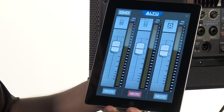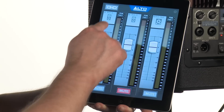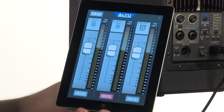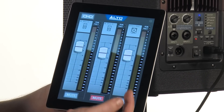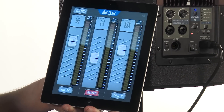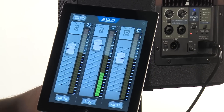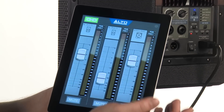When I open up the application after I've updated, you'll see here I have a lot of different controls. It's going to represent each one of my loudspeakers in my system by an individual channel strip. On these channel strips, I have a live VU meter with peak and fault LEDs, a nice long throw digital fader, and the ability to mute channels individually. I also have a chain icon that I can hit to control everything simultaneously.